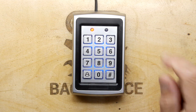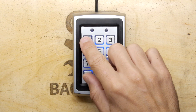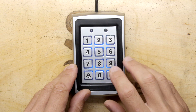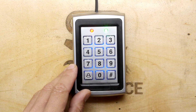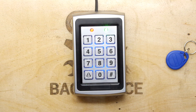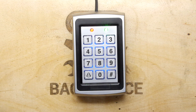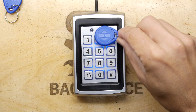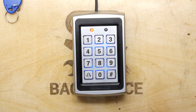I'm going to go into programming mode — it says press hash, 8, 8, 1, 1, 2, 2 for two beeps — and then enroll a new card by pressing 5 and starting at index 001. I'll just present the first card, then the second, then the third — I'm only doing three otherwise we'll be here all day. When done, press hash again. I heard a click — it works. If we take a tag that isn't registered and try it, it doesn't allow entry at all.